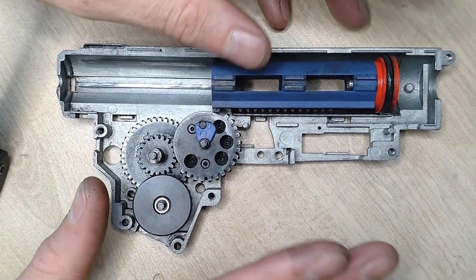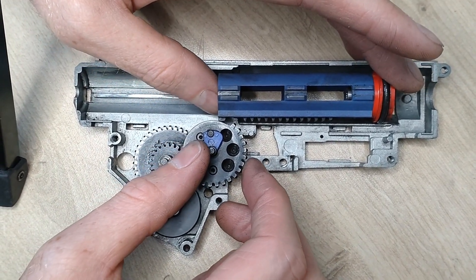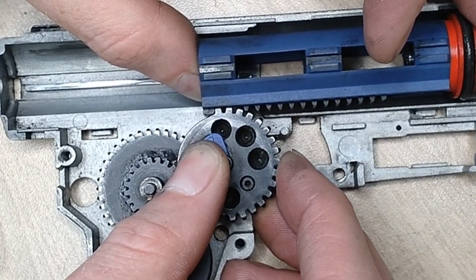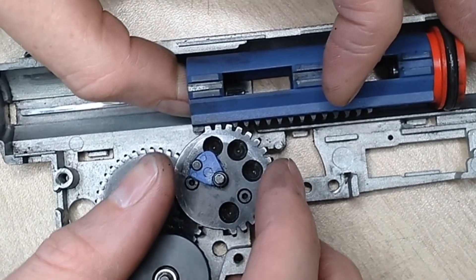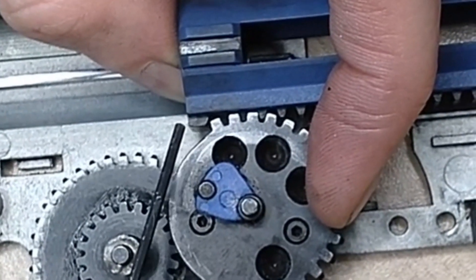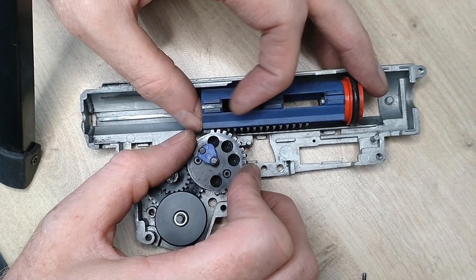It's been a few weeks since I started the initial recording — I just never got to editing — but it gives me an opportunity to add this one to the video as well. This is a slightly different style of piston, and a different set of gears, but the same principle applies. It's going to pick up there — fine. As we move forward, it won't be quite so apparent at the front here, but as that tooth starts to engage I can feel a resistance, and that resistance will be visible on the back here. Watch what happens as we rotate around: as that engages and tries to find its place, you can see the gap that's now opening between the initial pickup tooth and this one here.